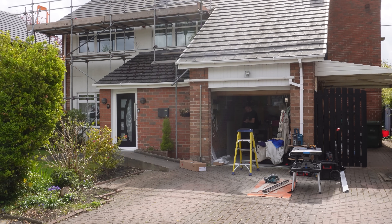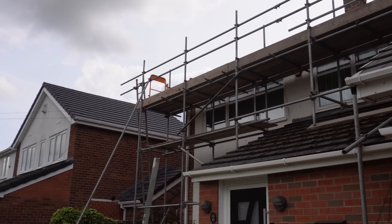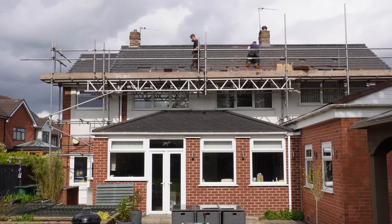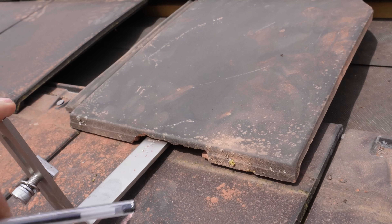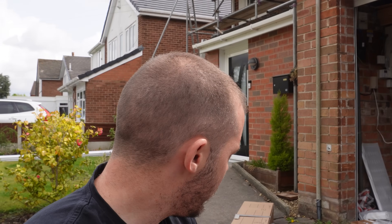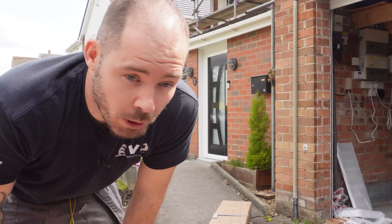Let's take a look at what Dale's getting on with on the roof. North is that way, so it's quite a north-facing roof — that's what the customer wanted. We're getting 14 panels either side and they're thin tiles, so we were going to use the genius flashing kit. However, Dale's managed to do a test and we can grind out one that's broken — there's enough room that the hook isn't putting any pressure on the roof tile. So we're going to go with that approach rather than the genius kit. It should be relatively straightforward despite being a large install, though we've got a fuse board to change and some circuits aren't on RCD, so that could go either way.